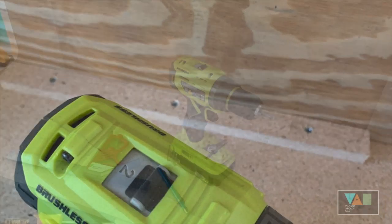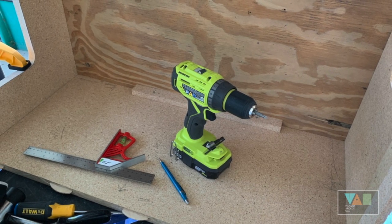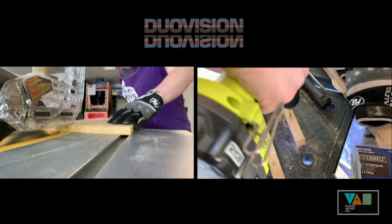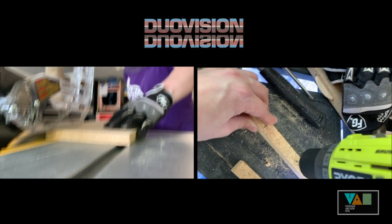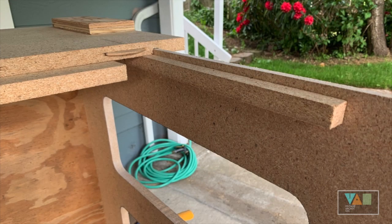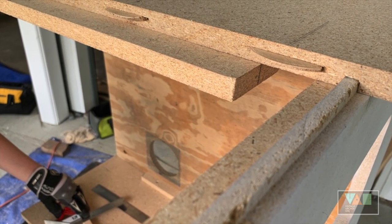This required the creation of these little guide pieces that were in the original part of the bottom of the cabinet — we made ours just a little more stout. So we cut our little joiner pieces and then put our guide holes for our screws so we wouldn't split the wood. Lo and behold, it is assembled and we're ready. Now you can see a little more detail of the biscuit and the overlap, and this little support piece on the side was to be screwed in when the cabinet was finally assembled for a little bit more rigidity.